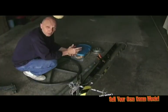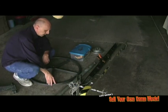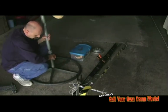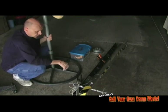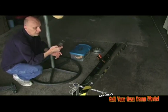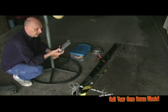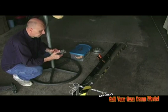Here's another piece of equipment Lloyd wanted me to share — my jib arm or jib crane. The base is an industrial fan base, which is tapped with a 1½-inch regular plumbing pipe, so you can use that as the stem. It goes in fast and easy and you can make it any length you want. The pivot point, which is called the clevis, you can buy at a warehouse — a friend of mine made this one and we screwed it into the cap on a 1½-inch OD plumbing pipe. That is the rotation and pivot point of the jib.